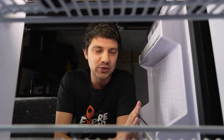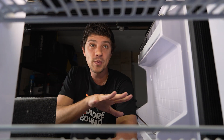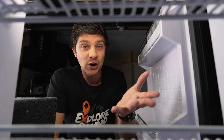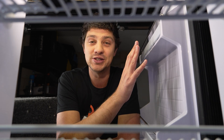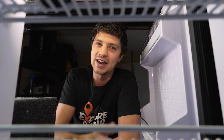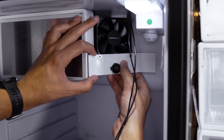The problems that these models have is because there's no factory standard fan built in. If you pack these beyond the recommended limit — like literally cover every single shelf full of food — there's no real way for the nice cold air to circulate from the very top of the unit down to your food in the very bottom of the fridge. So when you pack them to the limit, you can notice the stuff at the top is extremely cold, pretty much frozen, and the stuff down the bottom is only just lightly cool. The fan was a very cheap and easy way to get that air blowing around and ensure everything in the fridge remained at a nice constant temperature.